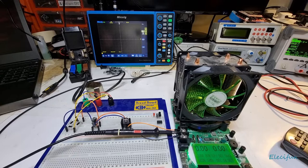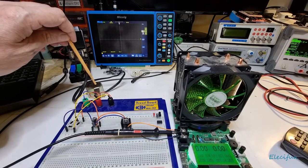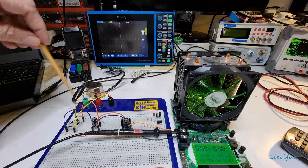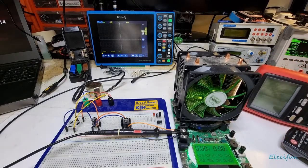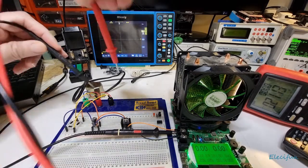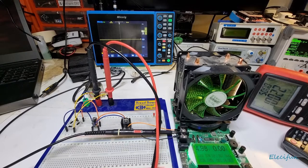Hi guys, I'm just going to share a quick look at what I've been playing around with. What we have here is a little AC transformer — only a tiny thing. The blue wire is just there because it's a center tap; we're not using it, so we've just got the two outer taps which will give us our voltage. Taking a peek at the meter: we've got 10 volts AC at 50 Hertz.